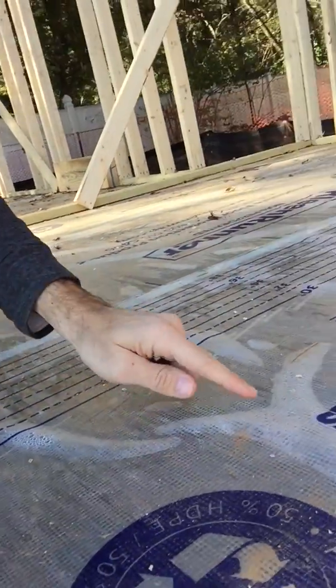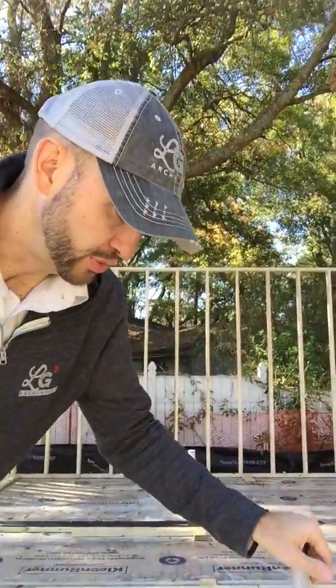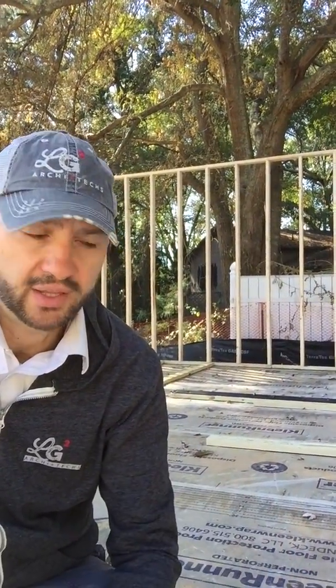In this little ripple here, you can see there's some moisture building up. That moisture is coming up from the slab. The added benefit of this wrap is that because it's going to stay throughout construction until we're ready to put down flooring, it will hold that moisture in and continue to let the slab cure.